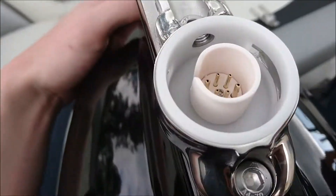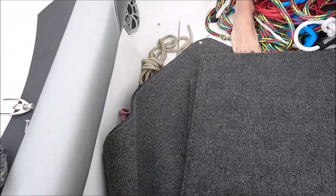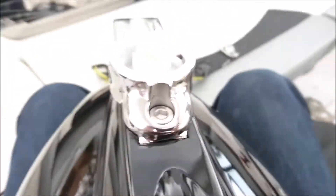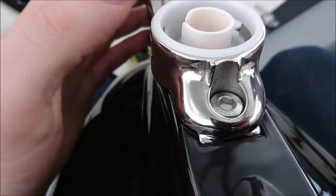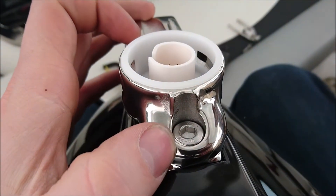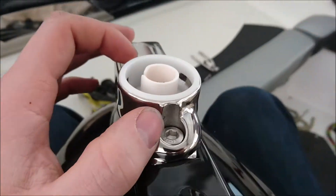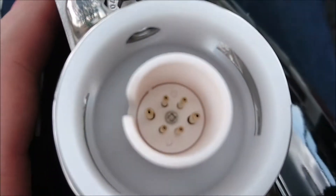Now that you've got this bolted on, use your short screws. You're gonna see some long screws but don't use those for putting them onto your speaker — just use the small ones. You can also lock tight them with blue lock tight if you really want, but do not use red lock tight on anything with your speaker or you'll have a nightmare getting it off.